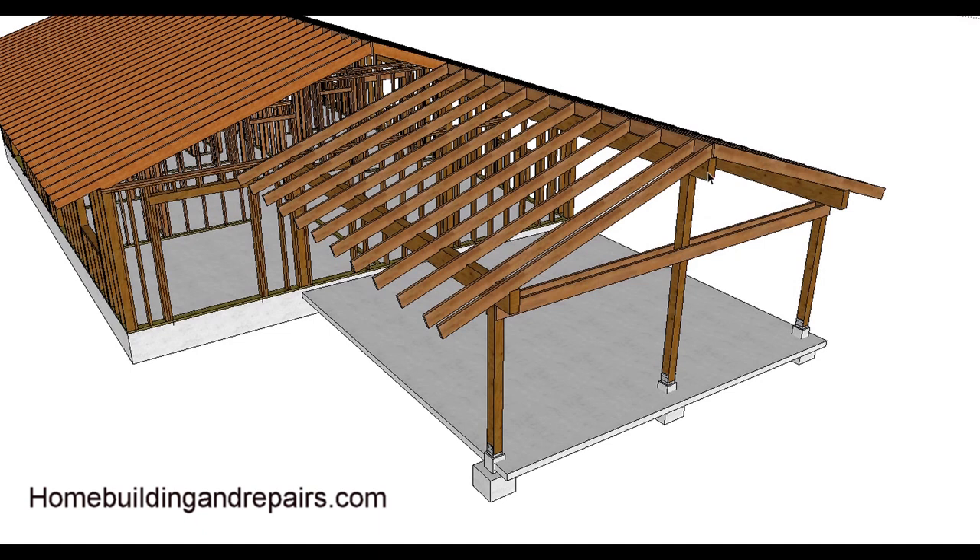The way the roof is built with the post - this post is supporting the ridge beam, preventing this from going down. If this can't go down, it would be difficult for the beams on the outside to move. If everything is built correctly - roof sheeting, seat cuts on the rafters, everything attached correctly - it'd be very difficult for these walls to move even if this brace was not here. In reality the braces might not be doing a lot.